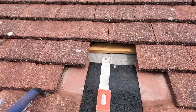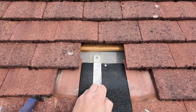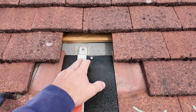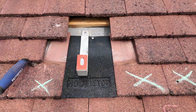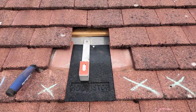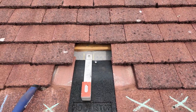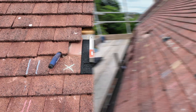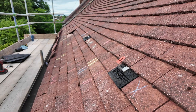We do just tap a clout nail into it to stop the tile moving. The tiles obviously pinch to the roof between the roof hook and the batten below, but we pop a little clout in just so it can't come down. That's what it looks like before we dress it back. Similar to other products like the Eric tile, there's no cutting and no grinding. So that's the first two in, and you can see the tiles sitting nice and flush back to the roof.